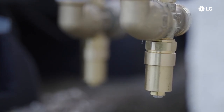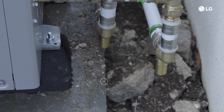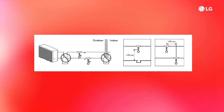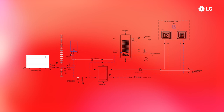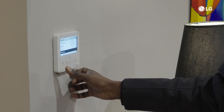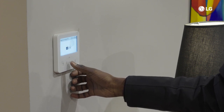Make sure there is no trap in the pipeworks. Keep a 15 cm clearance from the ground to prevent ice blockages. Maintain a distance of at least 10 cm between the antifreeze valves and ensure they're free from insulation for optimal function. The strainer provided with the outdoor unit must be installed at the inlet of the outdoor unit to prevent particles clogging the plate heat exchanger. Please ensure the installation of a magnetic filter on the path of the return flow. When using antifreeze valves, avoid setting a minimum cooling point below 7 degrees to prevent unintended valve openings.